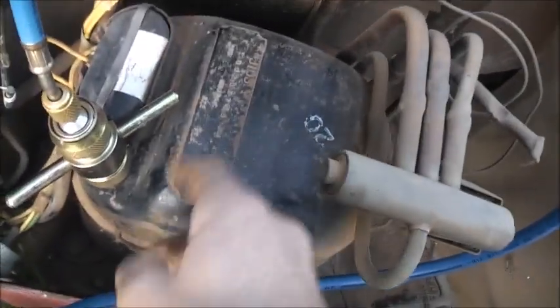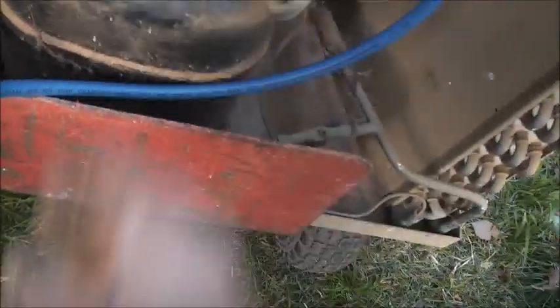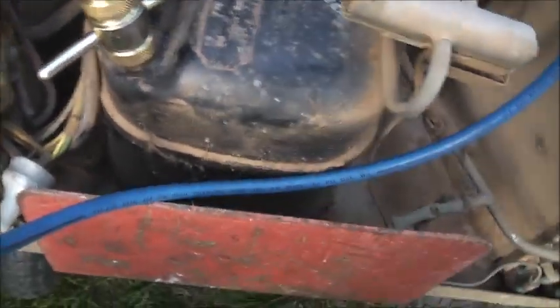So a newer air conditioner with a rotary compressor in it, I'm very limited in what sort of gas I can put in it. Because rotary is very critical in how it lubricates. They need a set gas to get the oil to carry around and lubricate the system. And it has a little accumulator on the side of the compressor, which is critical to its function. But these ones, nah. These ones here are pretty much KISS, keep it simple, stupid, base principle.